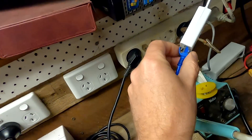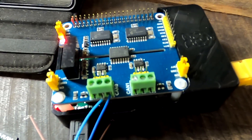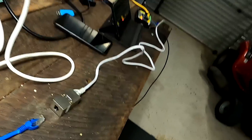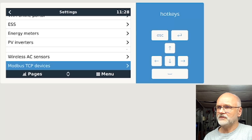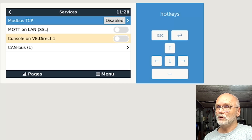If you log in as admin/admin you can change the protocol using the CAN drop-down menu. Set this to Victron, click OK — 'successfully changed the protocol.' Close, and if you do a refresh you will see it changes from Pylon to Victron and SMA. Then disconnect the RS485 cable and connect to the CAN port on the left-hand side — only the CAN high and CAN low cables, the light blue and blue ones, per the instructions from the last video.